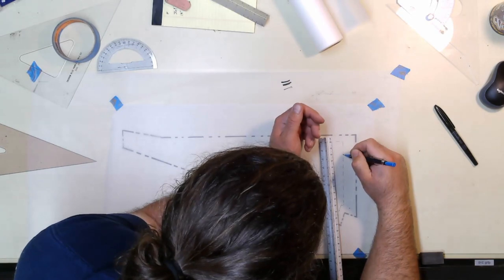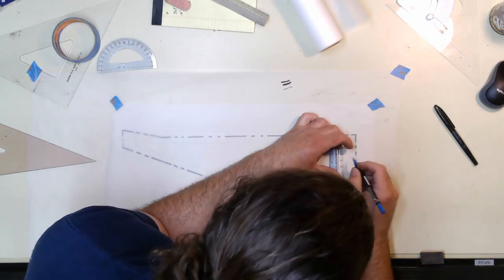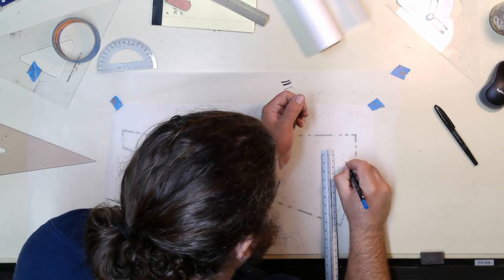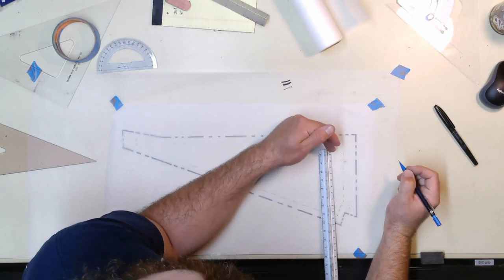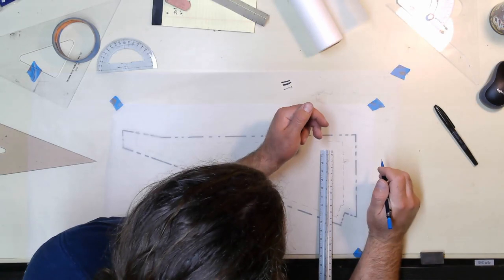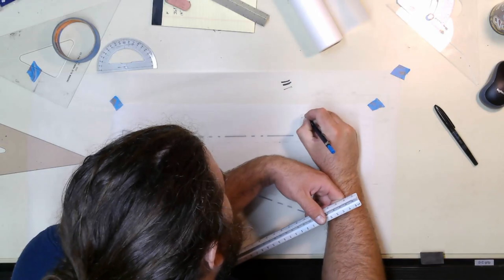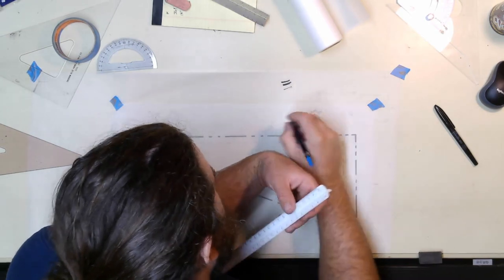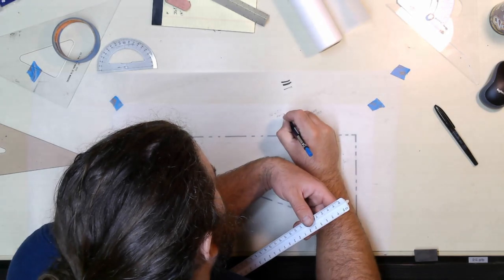So if we set here as a rough 20 feet, I'm going to do a 24 foot drive aisle. So I'm just going to write these down here. You don't need to do this, but I'm going to write it down. Hopefully you can see, it might be too small. Anyways, 24 feet for your drive aisles, and then 10 foot by 20 foot park.